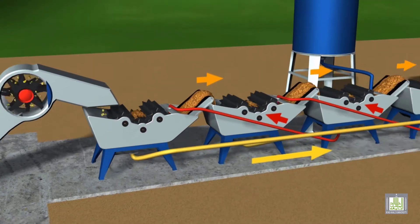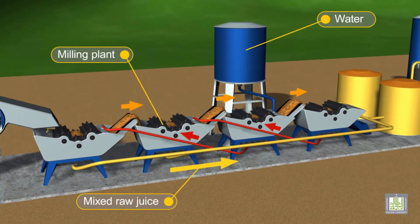After that comes the crushing of the cane, which is considered the first step towards removing the syrup from the cane. All the previous processes are applied to ease the syrup extraction process by increasing the active surface of the cane raw material. The milling process is then applied, where further crushing takes place. The addition of water is very important, as it increases the amount of syrup obtained and reduces viscosity, easing further processing of the obtained syrup.